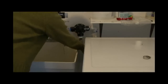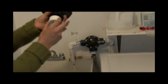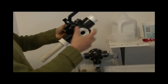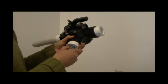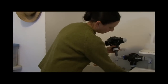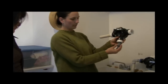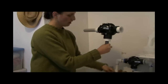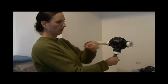Once the reducer is glued in, you can stick a piece of one-inch PVC pipe on either end. This is the connection from the machine — just the laundry hose. You put a different adapter here, this one fits in but has threads, so you glue that in. Then the laundry hose fits right over here and you use a hose clamp to tighten it down for a water-tight seal. Now you have attached your washing machine to this three-way valve and can easily send water to the sewer or gray water system.